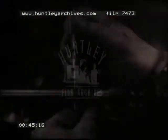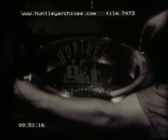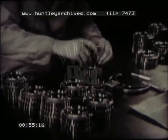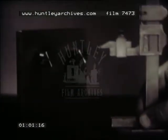Precision measuring tools are required in modern industry. Among these are micrometers, capable of making measurements in 1/1000th of an inch, vernier calipers, capable of measuring large work to close limits, and fixed gauges for production and inspection. In addition to these, there are many precision tools designed primarily for laying out work.